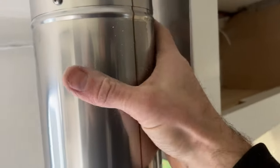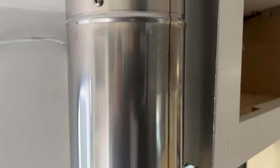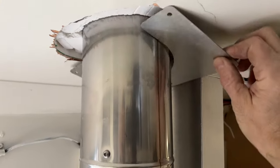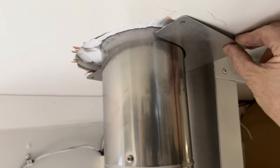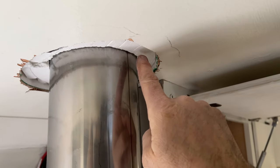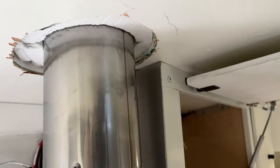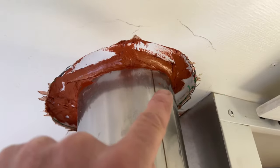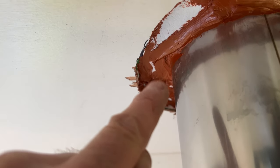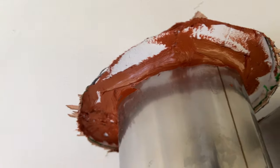Getting to the finishing bits now. I've got a piece of stainless over top of the cabinet, though honestly the cabinet barely gets hot to the touch. The stainless trim ring slides in up top, and above that I put fire-rated insulation — almost like a fire brick that goes in a wood stove. I'm sealing it all up with high-temp caulking around the pipe, around the outside of the insulation, and any seams that cracked, to prevent condensation when the stove isn't in use.